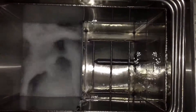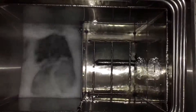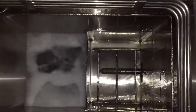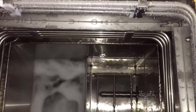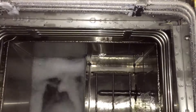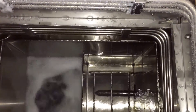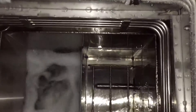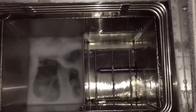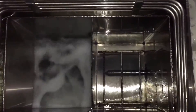So you get washed, rinsed, and dried parts out of the system in this small little footprint. With the cooling coils and their secondary — called vapor trap coils or subzero coils — they trap any moisture in the air from getting into the system and capture any residual solvent that may escape from the primary chilling coils into the secondary coils, to be extra efficient on solvent recovery. That's how a vapor degreaser works.